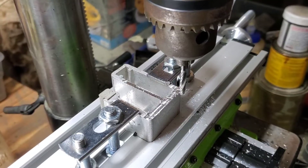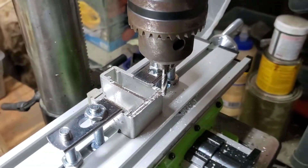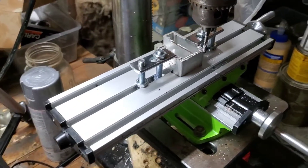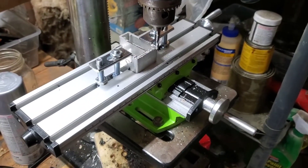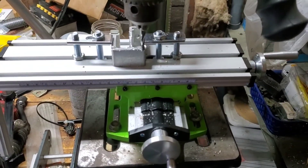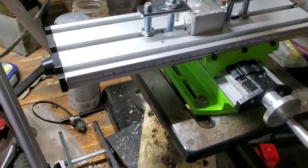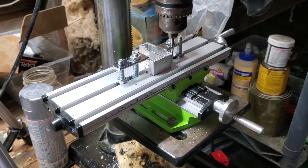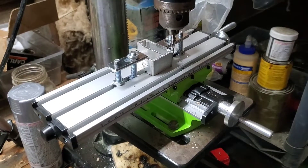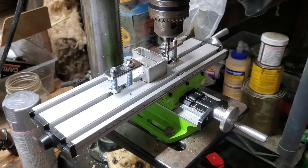It did well with wood, and I could see it working well with some plastics — maybe even composites like fiberglass or G10 — but for aluminum it really didn't work out very well, and I wouldn't even try it with anything harder than that. Your mileage may vary; obviously with a stronger drill press it might work out better. But again, for $30, it's really something you're meant to tinker with — not something you should be expecting to bolt to your cheap drill press and start doing complex milling with. It's just not going to work.